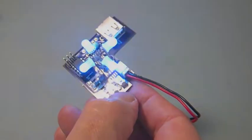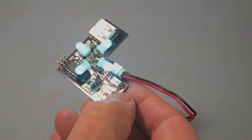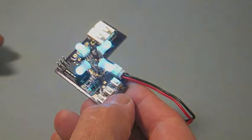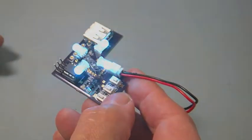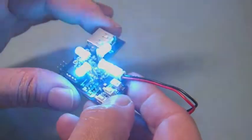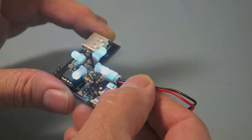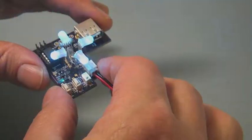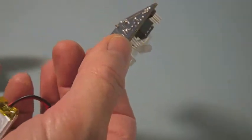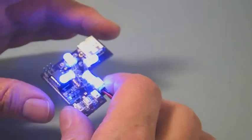However, you are changing four variables in RAM by doing this. They will not actually be committed to long-term memory unless you program them in. So all I have to do is turn off the holocron and it will revert to factory state. I can do this by pulling the cord, or I could do this by flipping the holocron over, because there's a tilt switch and that cuts all the power. So when I restore, the behavior is normal.